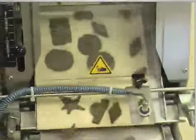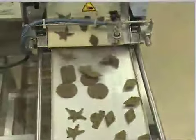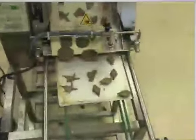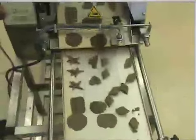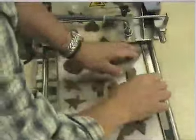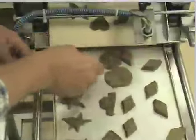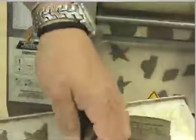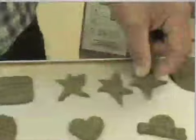Let me run this. They're sticking a little bit, but that's not really any major problem. I'm going to show you what we have here — I believe it's very cold. But if you see the dough and how it comes out, the thicknesses on this test drum: you can see an oval comes out, this is a little disc with an imprint on it, this is just a round diameter, that's the bottom where the knife cuts it. A little cold. This is a heart shape — working pretty good. This is a very thin star shape; that's not irregular from the knife cutting, that's the actual shape of it.